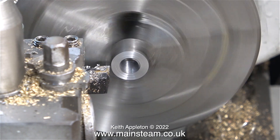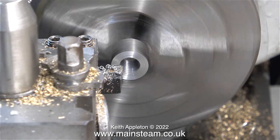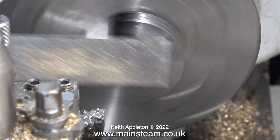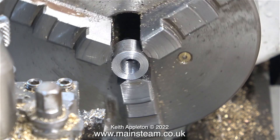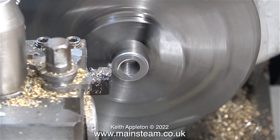The weight of the boiler is not just supported on these four collars. The centre part of the mountings — if you look back at the previous episodes or just continue watching this one — are pieces of flat bar. You definitely need to spread the load when you're mounting such a heavy thing as this steel boiler, which should come back into the workshop in the early part of the new year.